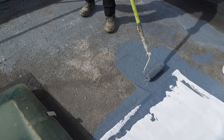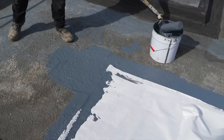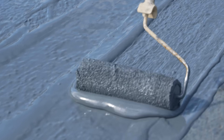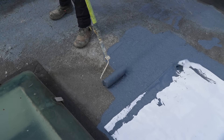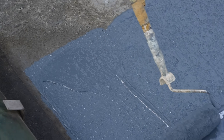When you put this on, a good way to check how thick it is: if you see the roller roll, it's too thin. We want to use this roller more like a squeegee — don't think of it like painting, think of it as just spreading it out. That's what we're after. Go back for another bit and you'll see that it just runs the bead out there.